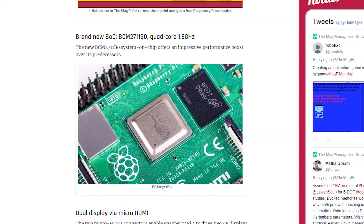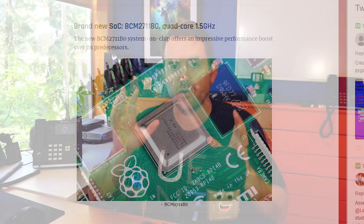The release of the Raspberry Pi 4 came with a tremendous step up in CPU processing power. The CPU is now a Broadcom quad-core running at 1.5 GHz. Of course, with the much more powerful CPU, we now have much higher temperatures coming off of that CPU, and the Raspberry Pi 4 has a set throttle at 80 degrees Celsius. So when you're running applications and pushing the Raspberry Pi 4 to its limit, you have to have some level of heat dissipation.